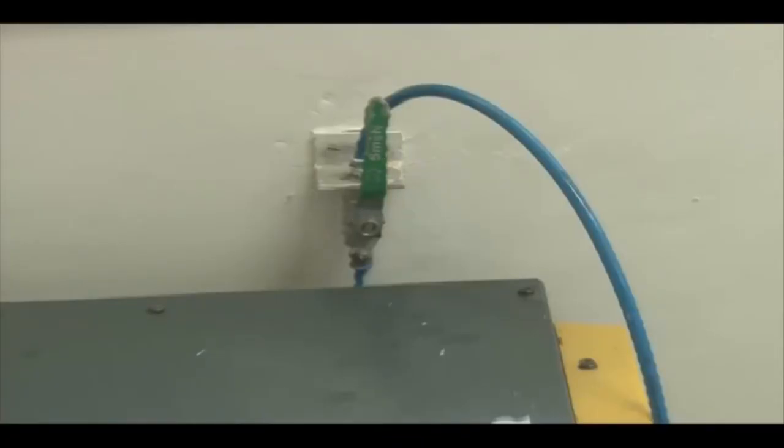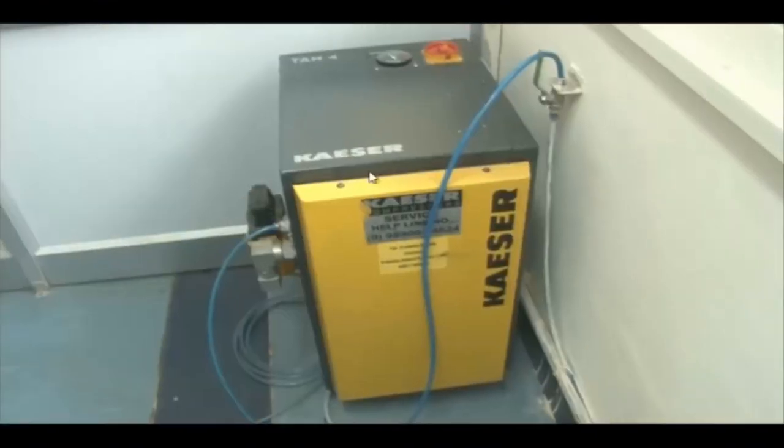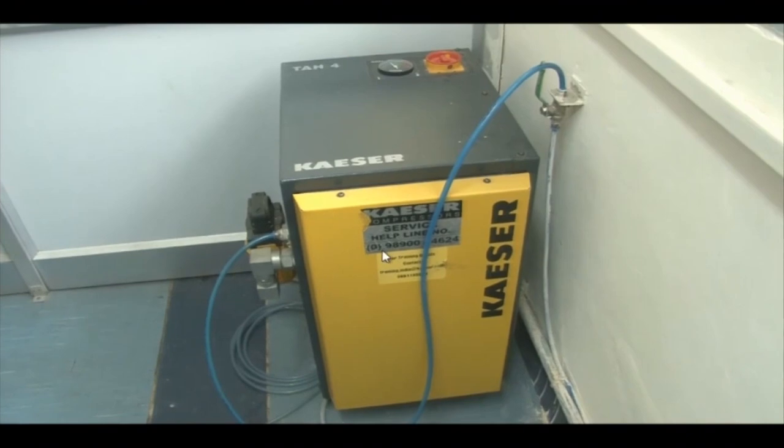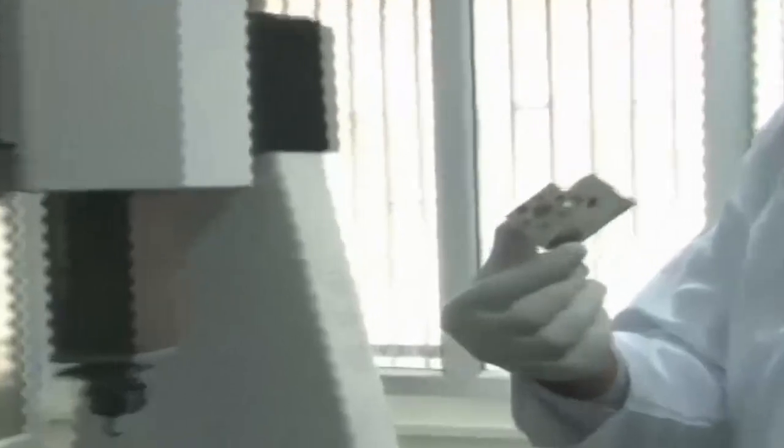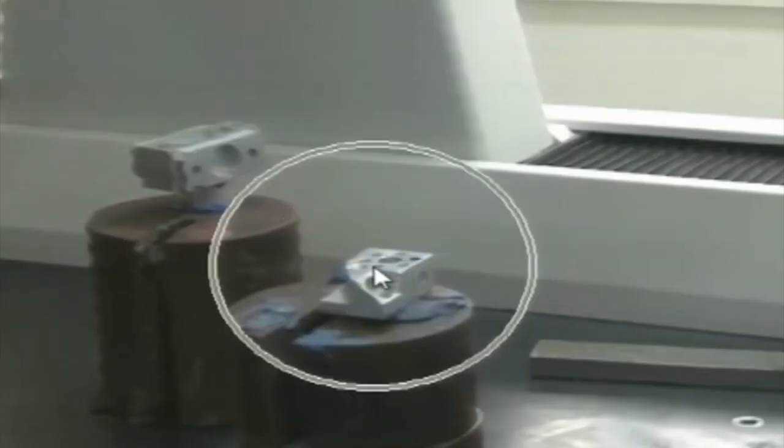The compressor must be moisture-free to protect the machine from corrosion and abrasive dust particles. This is the control valve; the front view of the compressor is a Kaeser air compressor. This coordinate measuring machine is used to measure the parameters of 3D objects — which may be complex geometry or specimens. It has three axes: X, Y, and Z. The workpiece we will measure has a number of circles, a center cylinder, six surrounding cylinders, and other features.